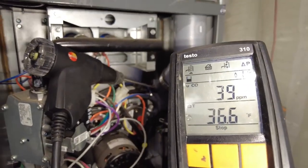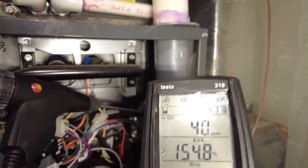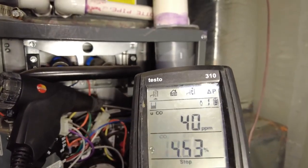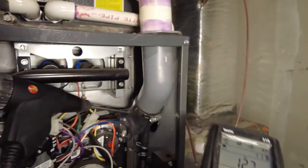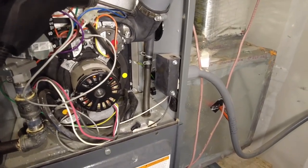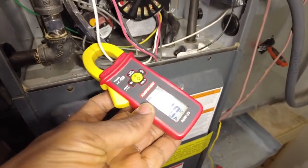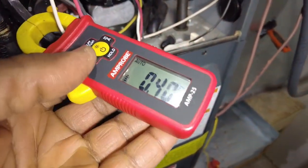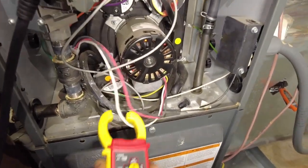This was both systems at the same house - a three-story townhome with two systems. The upstairs system had two zones, one for the middle floor and one for the third floor. He's been running the system like this for years. We've been to a bunch of these townhomes in this development and about 50% of the units have had this issue with the 90-degree elbow coming out of the inducer not having enough pitch - all on the upstairs units. Likely they just should have put a little more pitch on the furnace during install, or the way they installed the 90 to the exhaust pipe. Long story short, we went ahead and got him a quote to re-plumb his downstairs furnace flue pipe. Other than that he's good to go - systems are up and running, everything checked out on maintenance. Let me know what you think in the comments below. Thanks for watching.